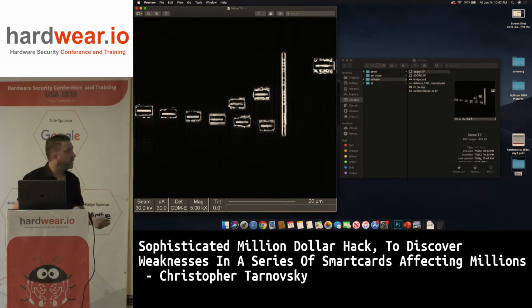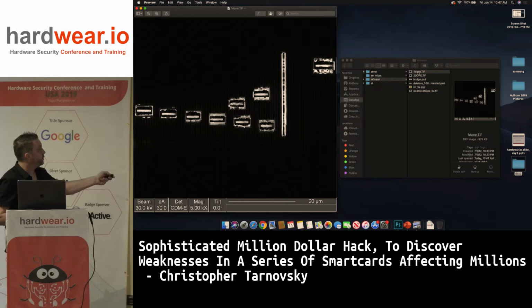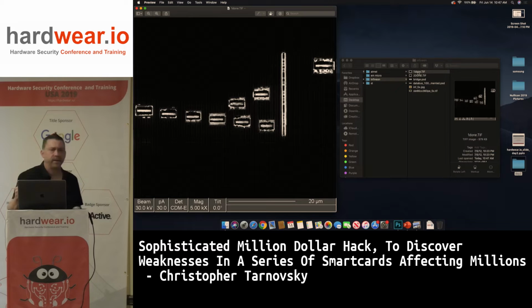When I'm done with the edit, it looks like this. You can see here's literally in order. It's going to be 0, 1, 2, 3, 4, 5, 6, 7. And then this one here should be that instruction register clock line that I'm talking about, that I can freeze. If I freeze it, it makes the processor walk.